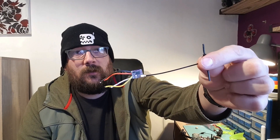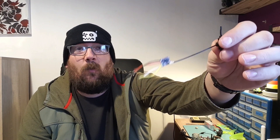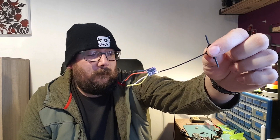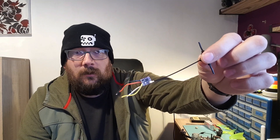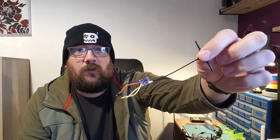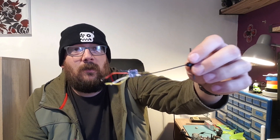The issue has been with the receivers that came in the pack with this module. In the pack you get three of them, but I've only managed to get one of them to work. Two of them have been stuck in what I think is bootloader mode. These were brand new straight out of the packet, never been attempted to flash or anything before. I managed to get one working absolutely fine straight out of the box, but the other two — no joy yet.